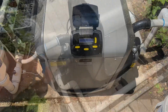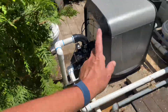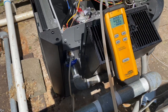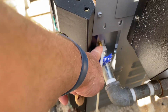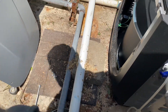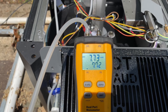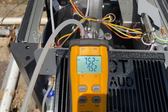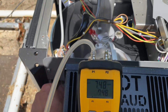I think we don't have enough water moving through this. By the way, one other observation: missing the required pressure relief valve — no bueno. I've removed the top, rear, and side covers. Using a digital two-port manometer, I removed the plug on the inlet side of the gas valve and zeroed it out. With the gas on, we're reading 7.8 inches of water column — 7.7 and dropping. Now reading 7.48 inches of water column.